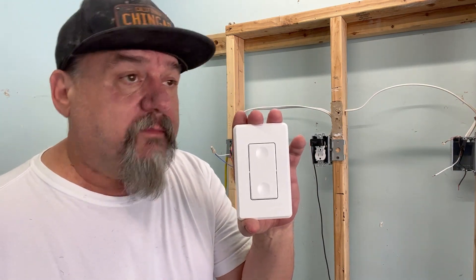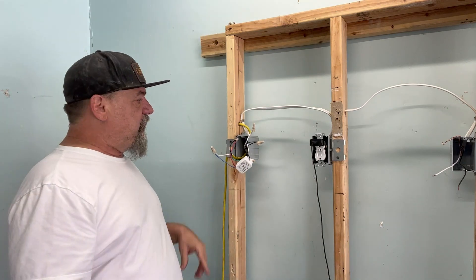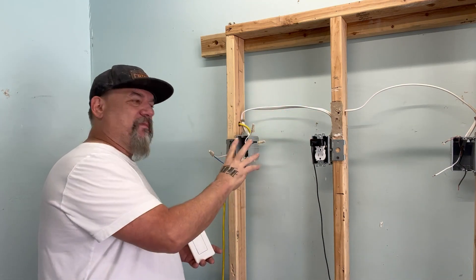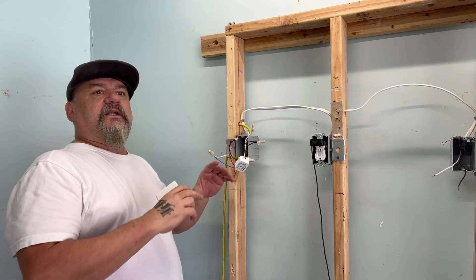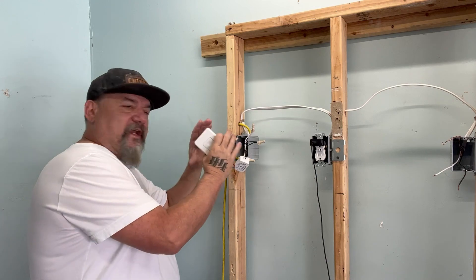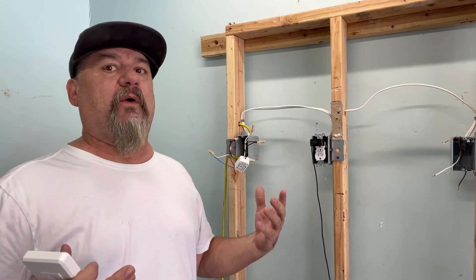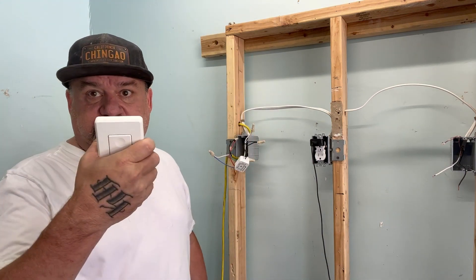All in all I'm giving this a 10 — this is crazy. A couple things to remember: we have the receiver at the beginning of the circuit, so anything down that circuit would now be on this switch. You'd be switching off all of your plugs — you don't want to do that. Just pigtail it down to the device you want. This is just for if you're going to use it for a lamp — most people would have it where there's only power and they don't know how to run a switch, so you just put it in a light box and put the switch there.